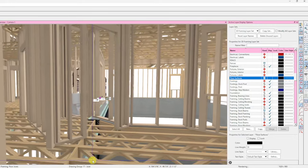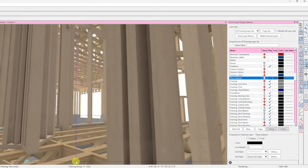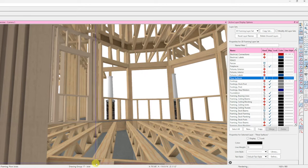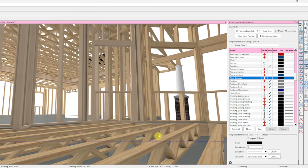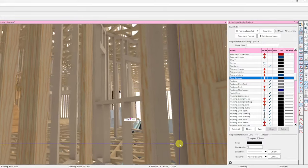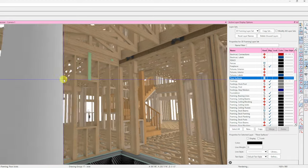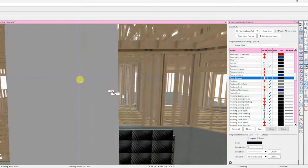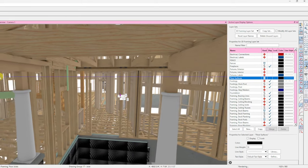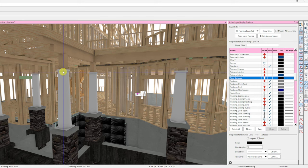You guys can decide if you want a rim board through here, because these did not line up. You could stabilize this if you feel it's needed — there's three-and-a-half inches of surface for nailing the plywood, but if you feel you want to stabilize it you can block between and nail however you'd like. We're on the main level now. These are to remind me that it drew a two-by member in here that's not necessary for holding up just insulation. In these columns I left the column on — this is a six-by-six post.